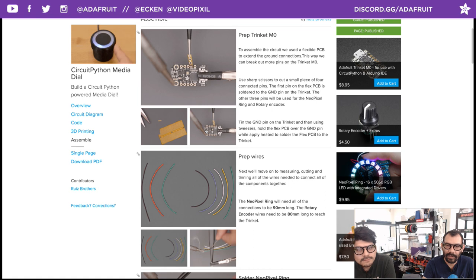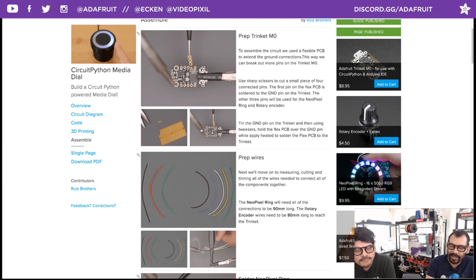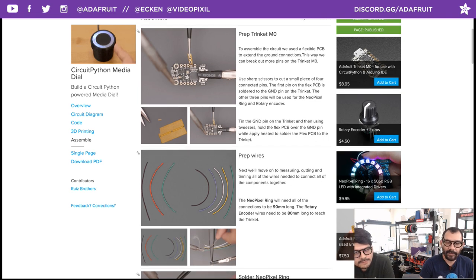Super simple for the flex PCB ground extension. You want to pre-tin the ground pin for that. Use a tweezer to hover above, and then just apply heat to solder that on. Make sure that it is definitely nice and straight. Definitely use tweezers, because you'll burn your fingers as it gets pretty hot. Right? It's very small, yeah. So if you scroll down